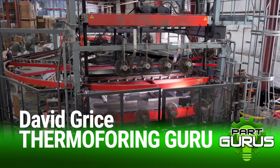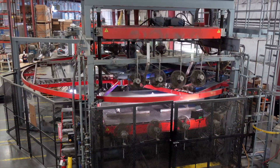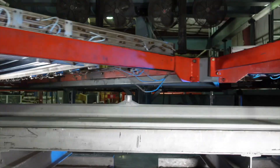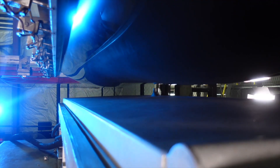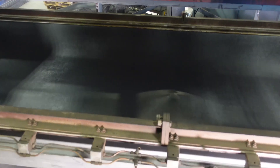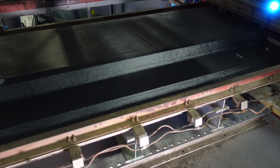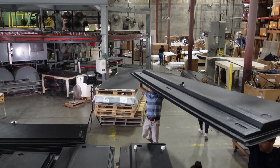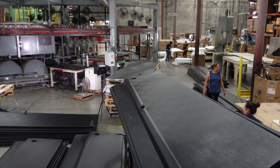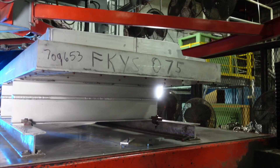As a rule of thumb, the more you manipulate those resins, the more stress you're going to build into a part. Thermoforming is fairly low pressure. A vacuum formed part doesn't have any pressure — it uses a vacuum to evacuate the trapped air. We do use pressure to force the material down in some of our processes, but we never get the material past its deflection temperature, and that's the key to keeping the stress out of the part. The material is heated in accordance with the sheet manufacturer's instructions for the deflection temperature.